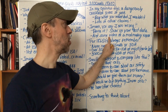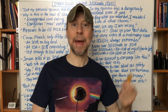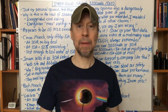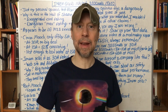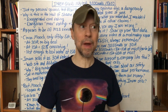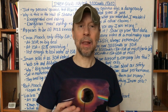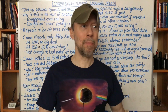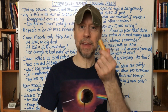Do not show me some stupid video of a mod making vapor using the batteries at 30 amps or something like that. I can take a 2 amp battery and a really low resistance coil or something else and can suck lots of current out of the battery, and I can make lots of vapor. I can make a flashlight very bright, but it's dangerous as all hell. The cycle life in the battery is going to be ridiculous because I'm damaging the hell out of it. It's useless to send me a video or post a video saying, oh, see, look how great this battery is. No, that doesn't show anything. Show me test data. Show me how you derive these silly 15 amp, 30 amp numbers.